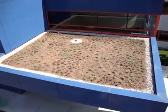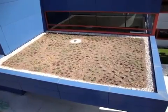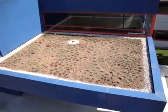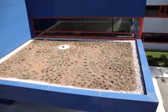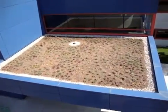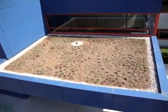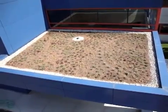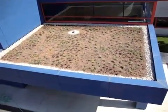Here we have our green roof, and I'd like to do an overview. The plants are in place, we have our growing medium, and river stone all around the edges and around the drain to prevent any roots from clogging up the system or growing over on top of the parapet. Below this, we have our geosynthetic, which was put in place to keep the growing medium out of the cups of the MS-20. Below the geosynthetic, we have the MS-20, which is also perforated so that overflow can easily drain underneath to the drain. And then below the MS-20, we installed a root barrier to protect the waterproofing of the roof from the roots.